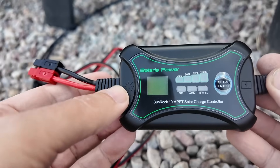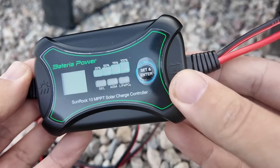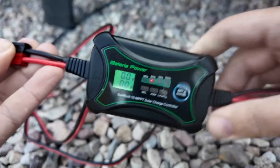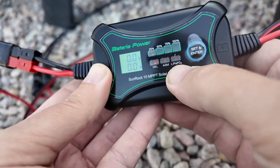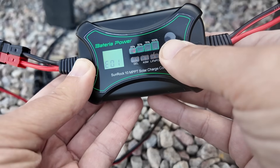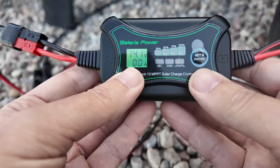On our solar charge controller there is a sun side with an embossed icon that looks like a sun with rays coming down. On the other side there is a battery icon that looks like a battery with a lightning bolt in it. I'm going to take the power pole connector from the solar panel and connect it to the charge controller. We've got power. I want to change my settings because it's set for a gel battery and I'm using a lithium iron phosphate battery. I hold in the set button and it starts to blink - press set again for AGM, press once more and it says LiFePo. Long press to confirm. Now it's confirmed, and it's showing E01 which means there's no battery connected yet.